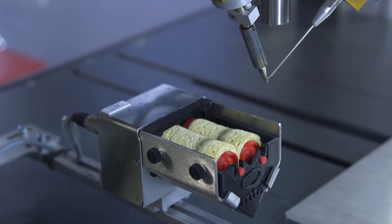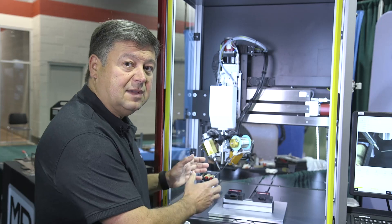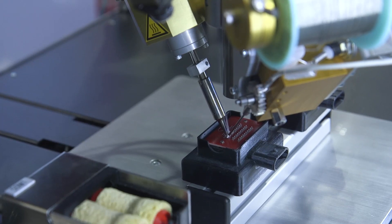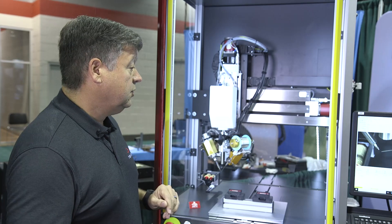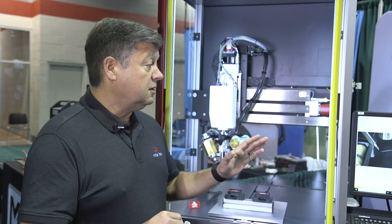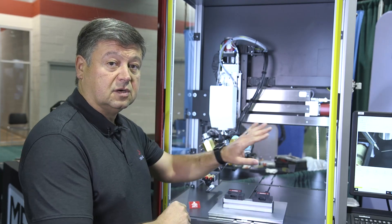This machine is purpose built. We don't take an off-the-shelf robot and put our head on it, because it's very difficult to find an off-the-shelf robot that has such a small footprint but is capable of carrying such a heavy end-of-arm tool as this head. We purpose built this one to support everything needed at the end-of-arm tooling within a small footprint. The light curtains and controls are included, and we have our own Windows-based software where all controls — robot motion, solder process, and light curtains — are on one screen.